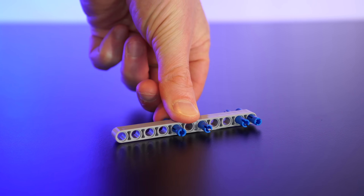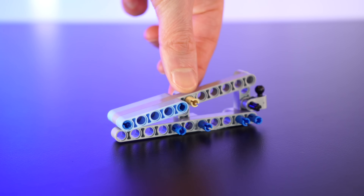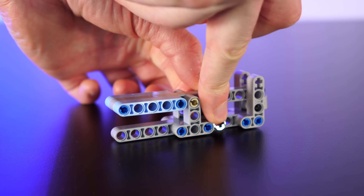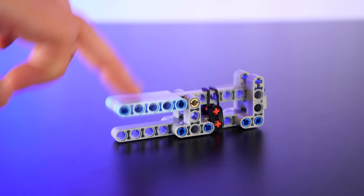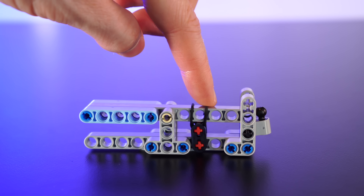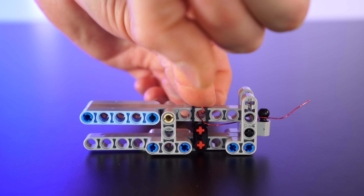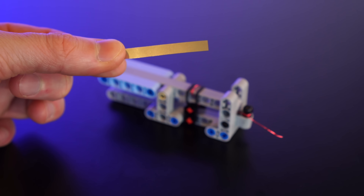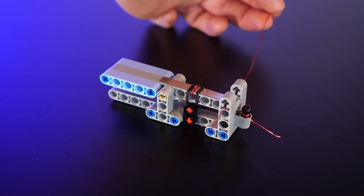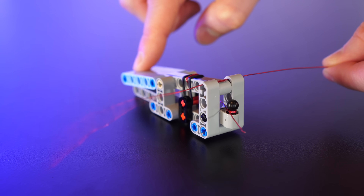Now that we know we can ring the drum nicely, we clearly need a keyboard to play it. We'll start by fashioning a key out of these lift arms, and an elastic band will once again provide tension to reset the key after it's pressed. Now we can tap away and the key will press and then reset back to a much more normal position compared to my first attempt. The other end of the key will be where we make contact with the solenoid, and to do this we'll wrap a little bit of copper wire around the end of the key. Then this strip of conductive nickel will make contact with that wire, and is held nicely in place by our elastic bands. Running through the top of the key scaffold is another wire which will be able to close the circuit when touched by the nickel. Let's give this idea a quick whirl to see if it works.